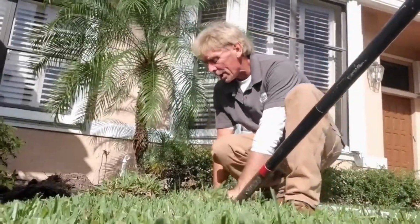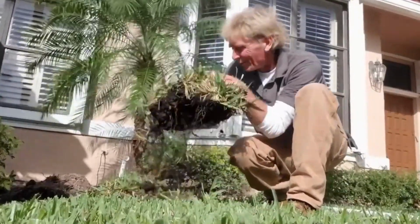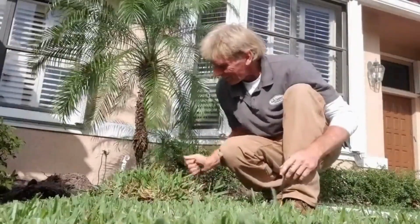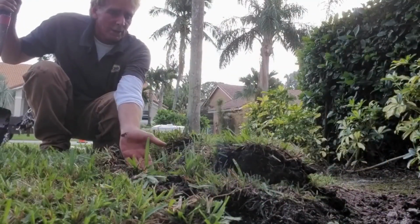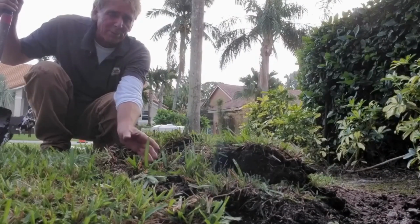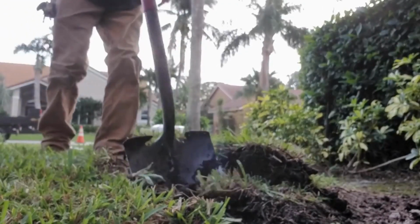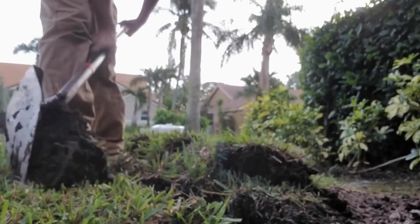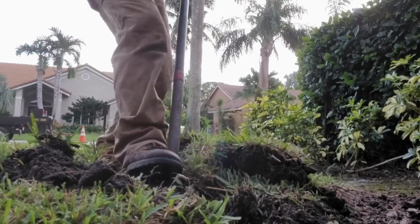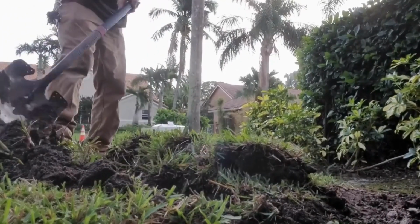In Florida and other southern areas, it's a grass, it's like a vine, and it's a great grass to cover, but you can see it's a vine. So we'll pull all this. Once you take your sod off, we're just going to trench out our area to put our 1.5-inch pipe in. Remember, it's only about 6 inches deep because it's going to discharge up to the top. Always work backwards. Use your foot and just set your soil right beside your trench. Dig back a few feet, and then you come back and you scrape it out, and you've got the perfect depth.